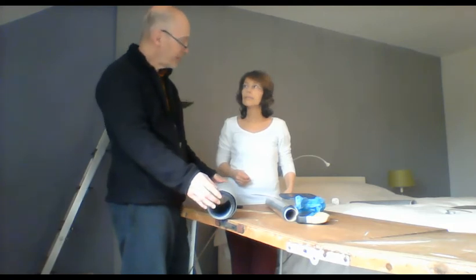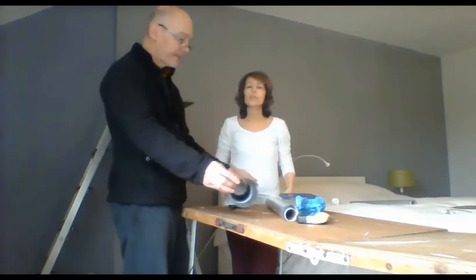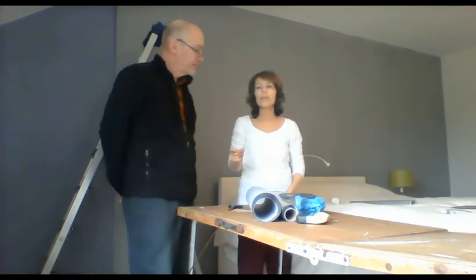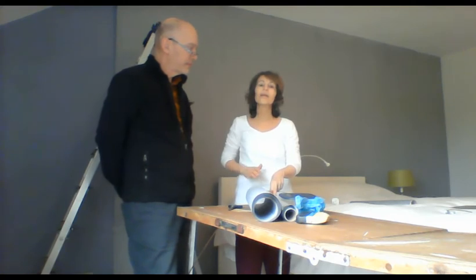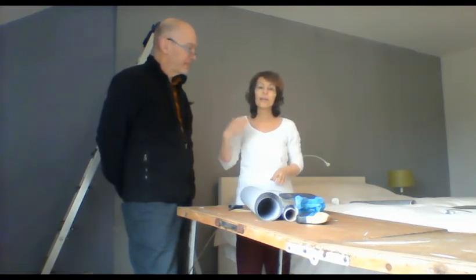So we normally have it overlapping at about 1 centimetre. About 1 centimetre roughly, actually. I mean, walls are not completely vertical, so you may find it overlaps 1 centimetre at one end and half at the bottom. But it's always good to play safe and have an extra centimetre. And what's important is that aluminium doesn't show through. That's why again you've got to make sure all the aluminium is covered by this paper to avoid the reflection back into the room.